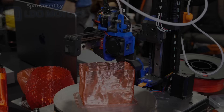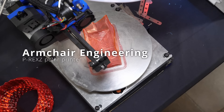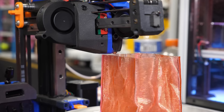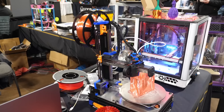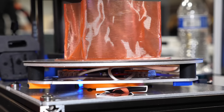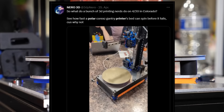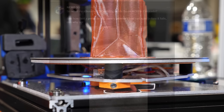The next cool and unconventional printer I saw was the P-REX-Z, a Polar Core XZ printer designed by the Armchair Engineering team. Polar 3D printers aren't something we see a lot these days, even though they do have their benefits. One perk is that it needs the least amount of motion system for its build volume — since the bed is spinning, the X-axis only needs to move the radius of the bed, not the full diameter. Even though there are some non-standard hardware challenges to figure out, like getting the heater and thermistor wires to the infinitely rotating table, they simply solved that with a slip ring.